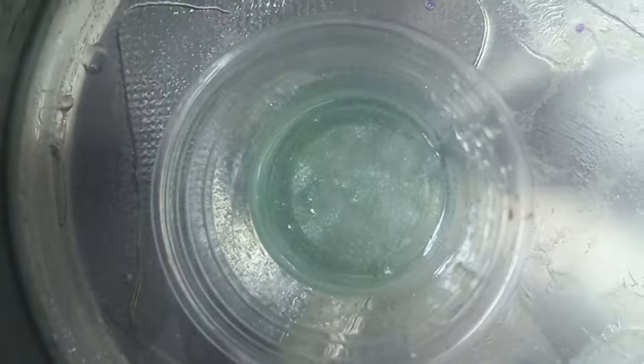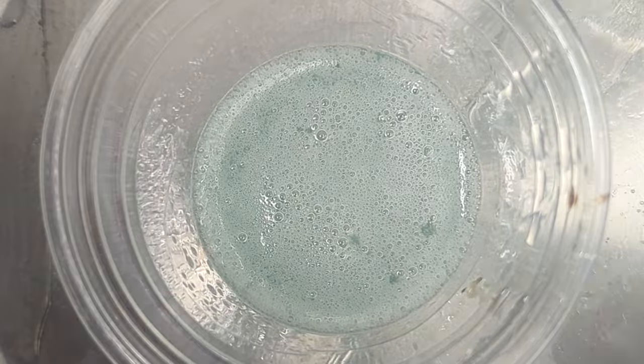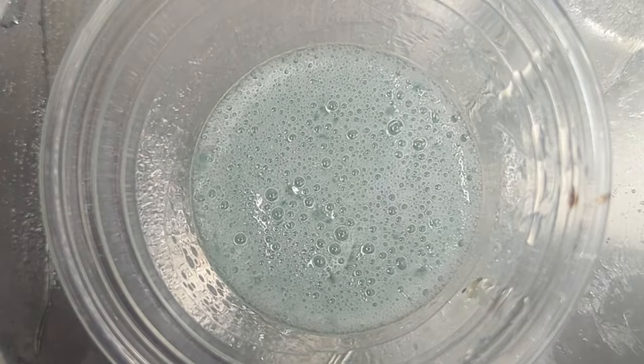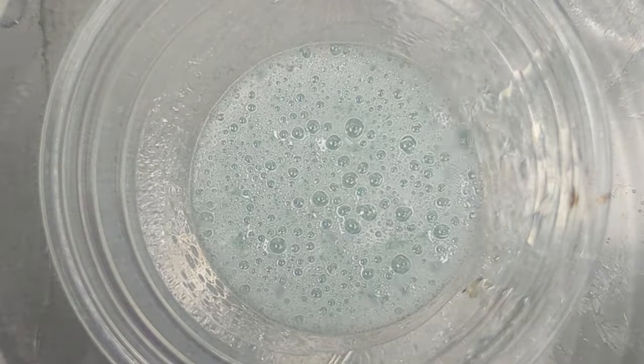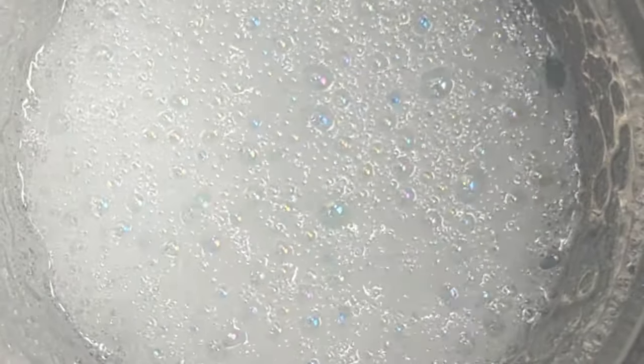Now into the vacuum chamber. This is what's really gonna make sure all of the air bubbles that are trapped in the resin itself get out. Casting under pressure 9 times out of 10 will do it for you, but to be perfectly honest, I didn't wanna mess this up after putting all that work into painting these skulls. So I went ahead and hit it with a vacuum.